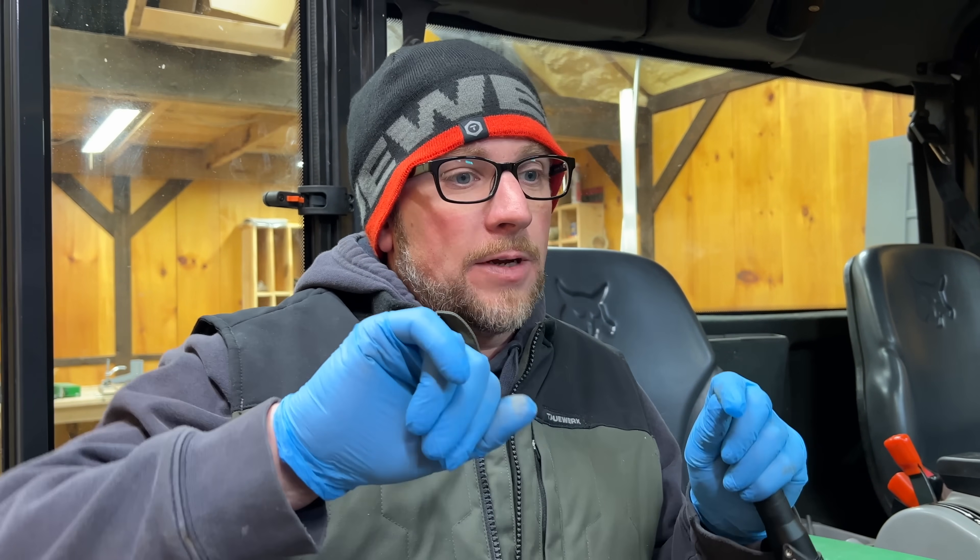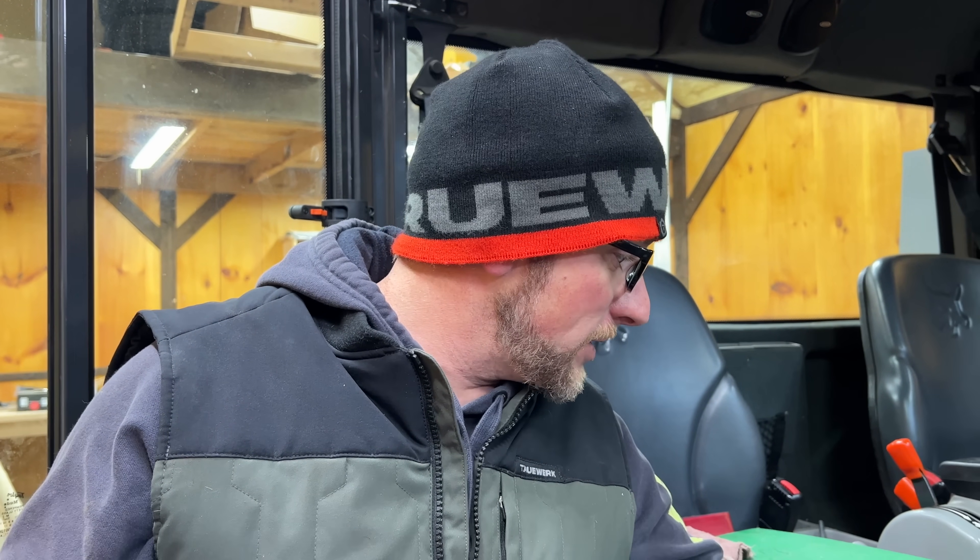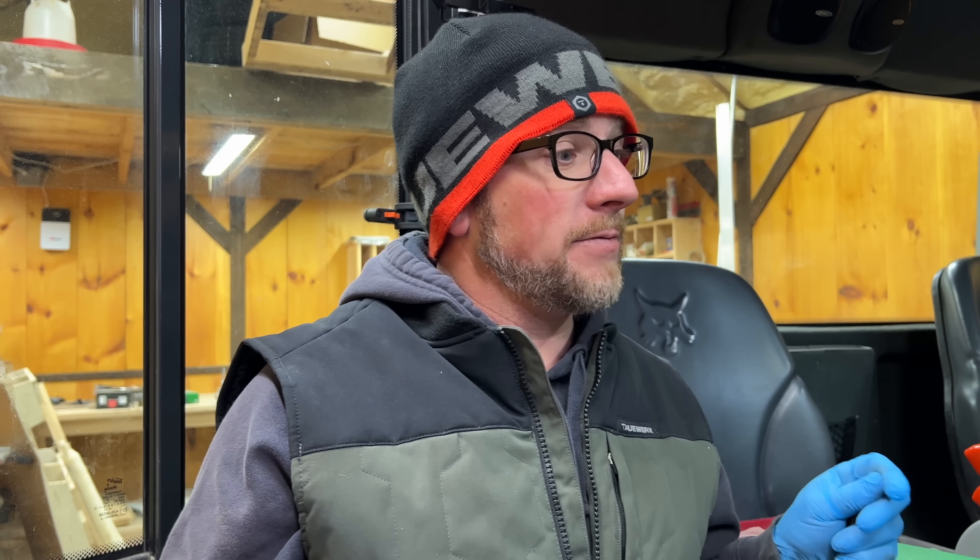Don't have stuff up in the air. This one right here does the curl of the bucket. We have the bucket down and we're not under it. If you had this bucket up in the air and it was the hydraulic for the main piston and you took that hose off, that's going to come crashing down on you and could squish you. So when you're working on hydraulics, always, always, always safety first. If you've got to work on a piston that's up, they do make safety blocks. Just always be safe.